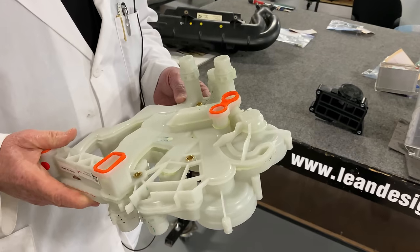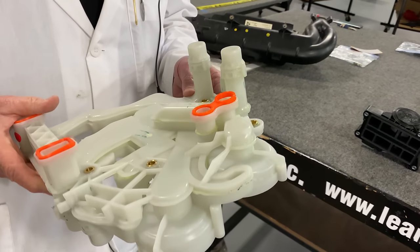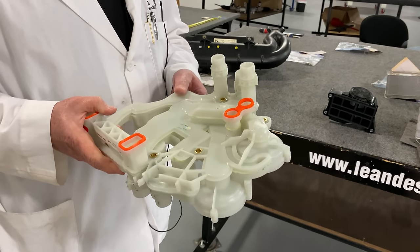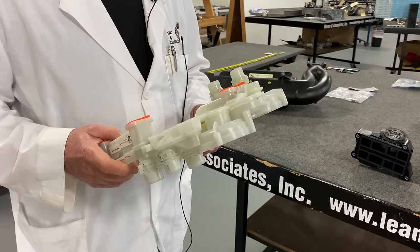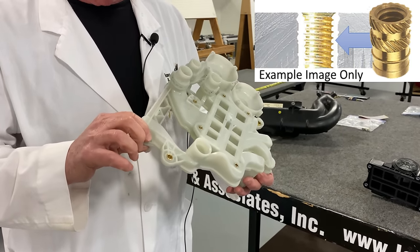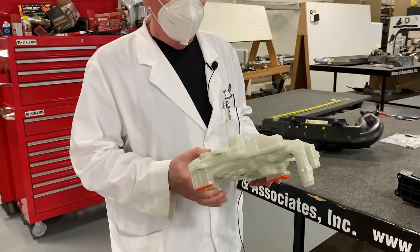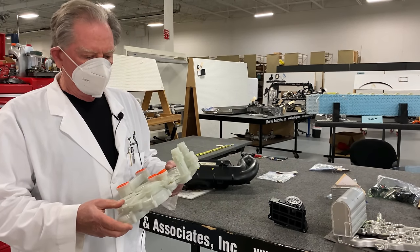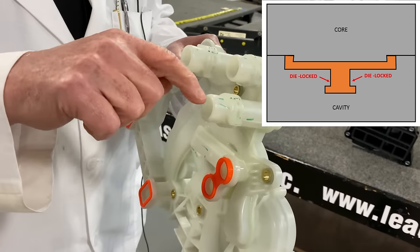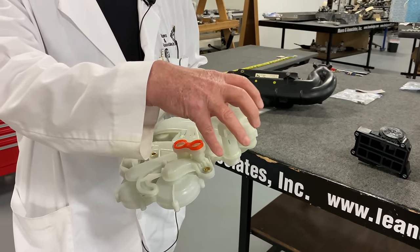The coolant manifold is in essence made out of molded nylon. It's got 11 separate pieces and 21 ports that are glued into this thing. You can see from the front and the back that these components are basically hot plate welded into the base. You'll also notice there are some inserts put in on both sides — some threaded and some just for crush, so they don't have a way of breaking off the plastic. The reason it's made in so many components is because of draft angles — there's no way of pulling the pieces apart if you add too many features.